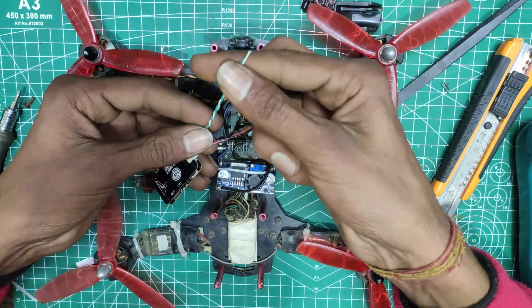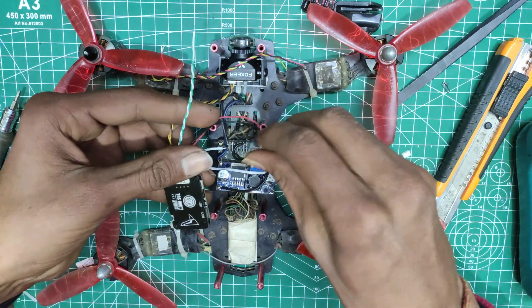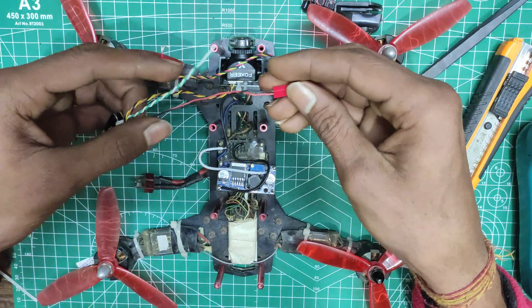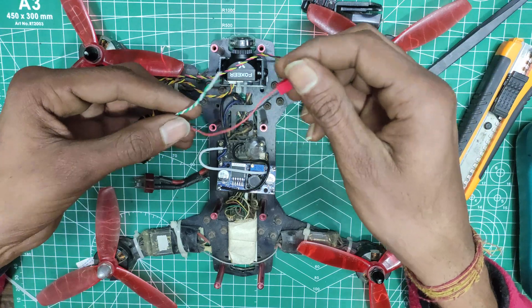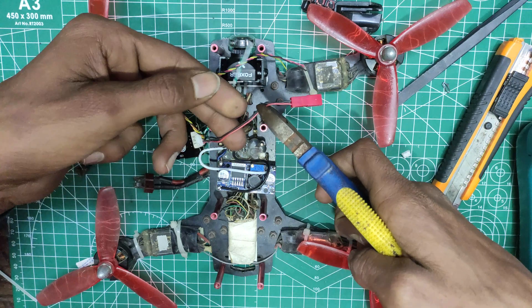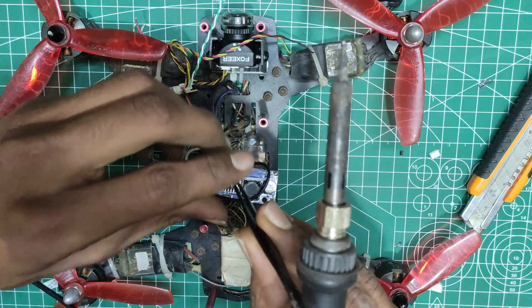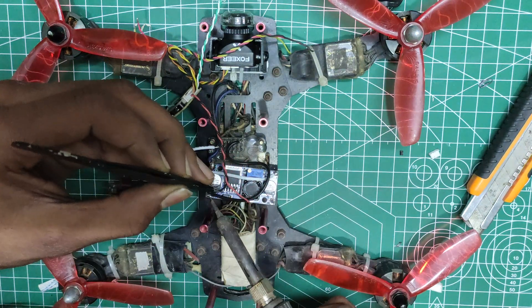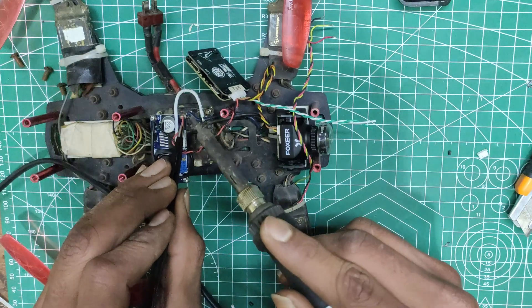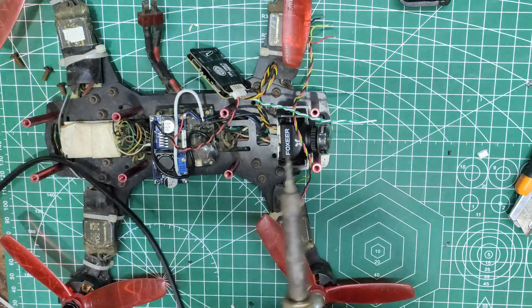These are 2 wires for the on-screen display (OSD), but as my flight controller is a CC3D I will completely skip this for now — I will complete this once I replace my flight controller. The 2 wires left are the black and red power wires, and they need to connect directly to the battery. This VTX can work from a 2-cell LiPo all the way up to a 6-cell, so no worries connecting them directly to the battery. These wires are just coming straight from the battery connectors.